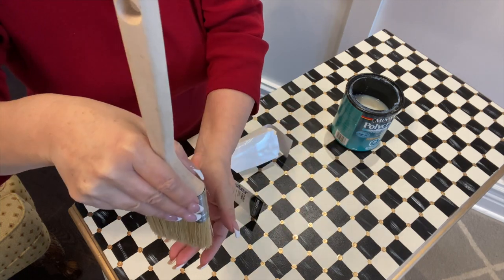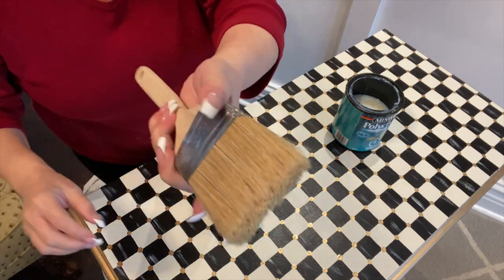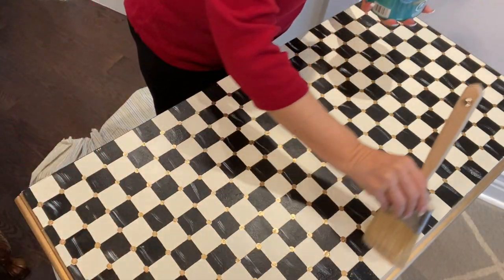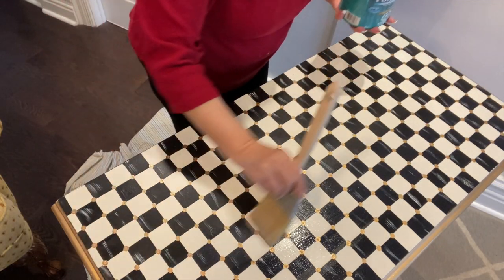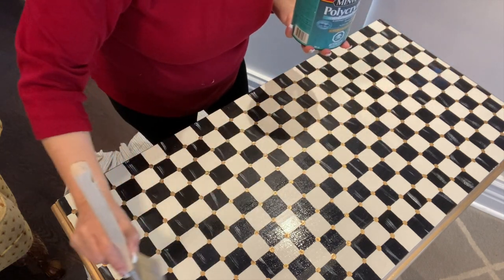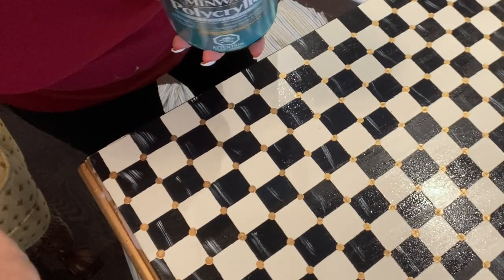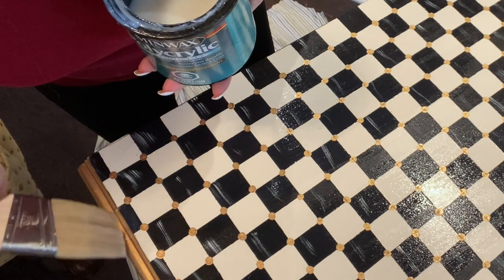Once it's well washed, hang it to dry. Once it's completely dry, I put it back in the package. This is not a new brush — it's been used lots of times and it's still like brand new if you take care of it. Go the same way, all the way across and then that way. This is to avoid having more sealer or less in some spots. Don't go sideways — it kind of puddles, so you're going to have to brush that out or it's going to dry there, and you definitely don't want that.